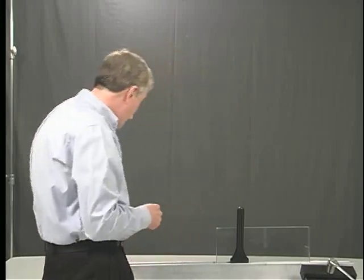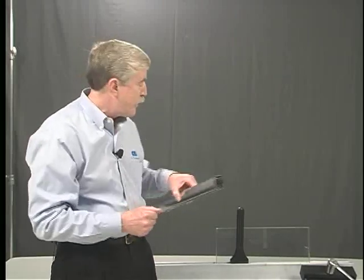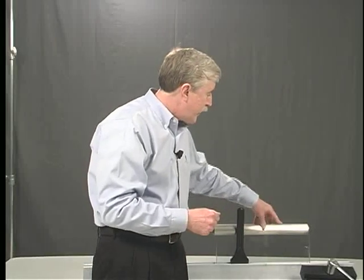It's a little bit different so it can take up all the different tolerances in the laminated glass. Remember, you must select the correct base shoe for the correct laminated glass thickness you're using, and also the correct taper. The laminated tapers are all the same, but the L push block that goes on the back of the glass is a slightly different thickness, so make sure you have the correct set and the correct base shoe. We also have all of the correct top caps for all the different new laminated glass sizes available for the taper lock — it goes right on top of the glass and finishes it off nicely.